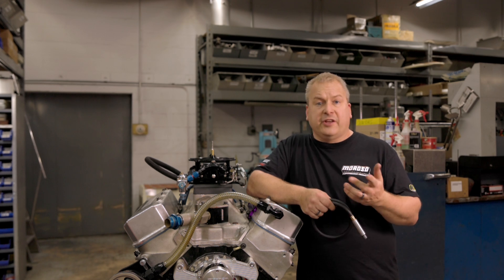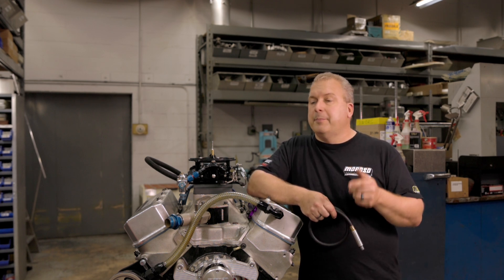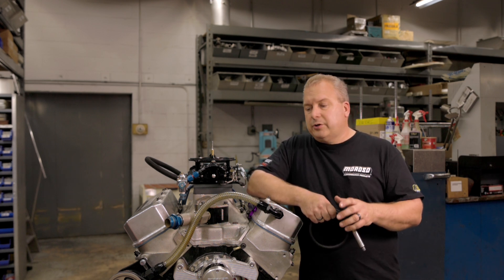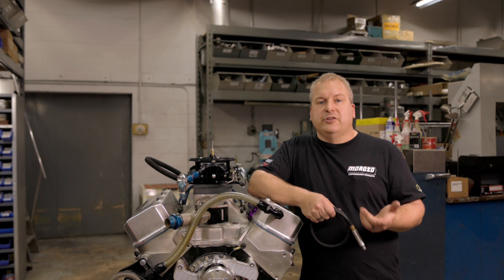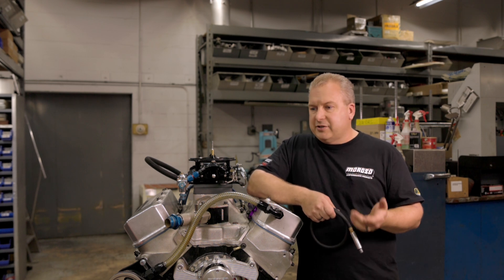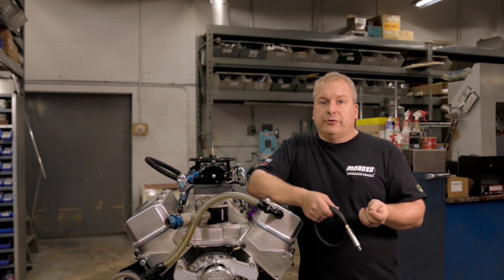I want to end this video with a couple of quick tips and things that I've learned over the years dealing with some phenomenal engine builders and race teams when using a leak down tester. Obviously at Moroso we're in the business of selling leak down testers, but also making vacuum with a lot of our oiling system components. So getting an idea of exactly what we're looking for and how to understand what you're reading is very important. One of the most critical things I recommend all the time is leak down an engine when it's hot or warm — you want it to be as close to race condition as possible. An engine's expanded, everything's in its working range — that's when you want to leak it down. If you leak it down cold, you may get a higher reading because things are going to contract and air may blow by in areas that normally wouldn't. But when you compare all the cylinders on the motor, you're going to know if you've got a motor that's happy or a cylinder that's maybe hurt.